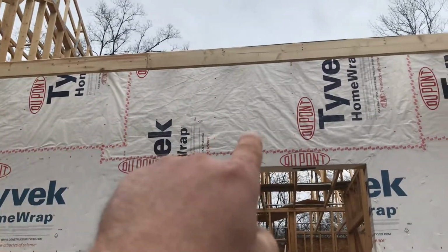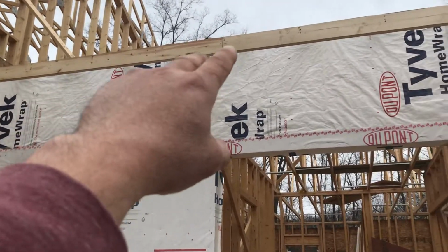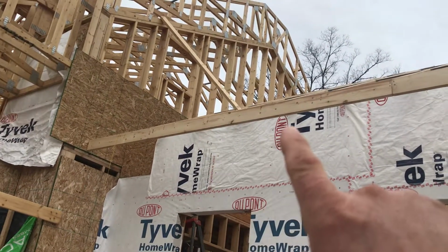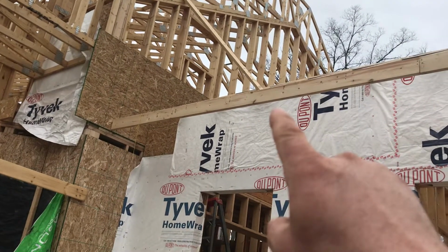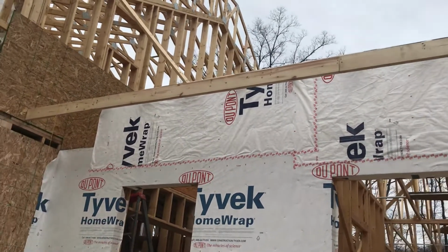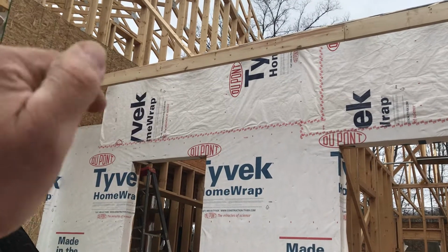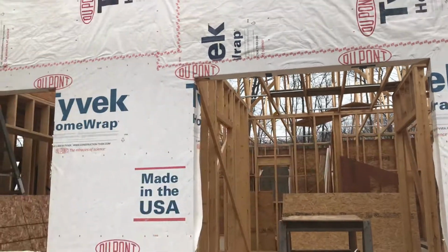But you don't want crowns like this going through your roof. So what you do is, once that string's there, and like I said, you set the little middle ones slightly lower than your string, pull the string super tight, and then you just work your way this way, and you pull this nail. Once you have like 1 or 2 shot in, you can pull this nail that you held temporarily, and you work from left to right or right from left, and you just pull it up to your string as you go. And then what happens is when you pull it up to the string, shoot it, pull it up to the string, shoot it, it forces the crown to stay flat as you pull it up.